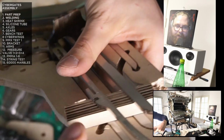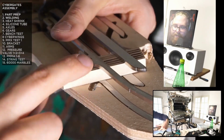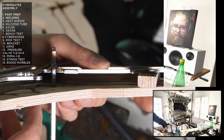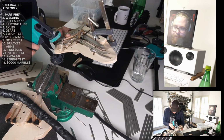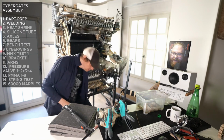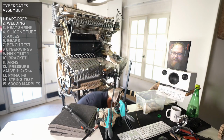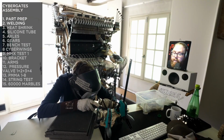So here you kind of see that we have this plywood spacer we just made. If we look from the side, you can see that it's parallel with the jig now. And then I can just clamp here over the spacer. Well done. I'm cautiously optimistic now because the jig looks good, the positioning looks good. I think we're within our accuracy level needed.